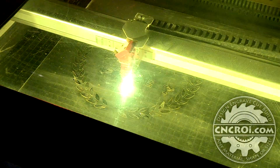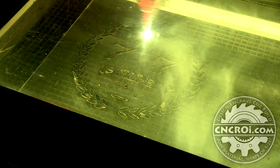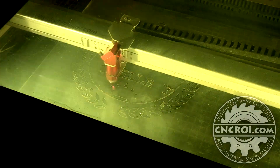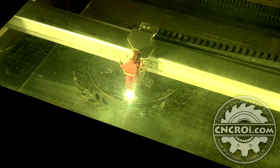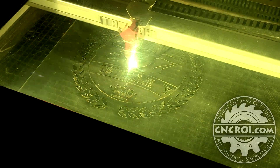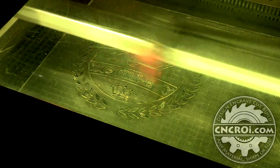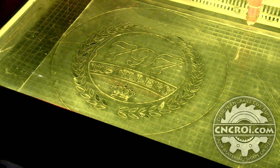The only thing I've got to watch out for when laser cutting — which is why I don't leave the machine running while I go do other things in the shop — is those little pieces that you see flying up after they're cut out. Those sometimes fall onto areas that need to be cut again, over a cut path, and the laser cuts through that stacked material. Sometimes pieces pile up and the laser doesn't have the power to go all the way through. The laser is not a very smart machine — it just does what you tell it, with no idea what it's doing.